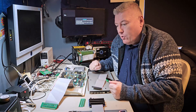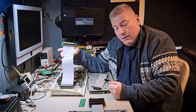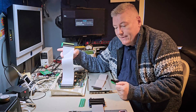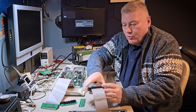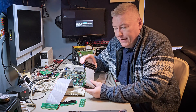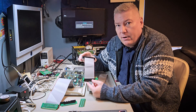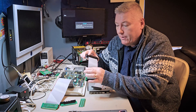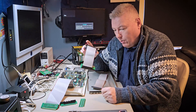So let's summarize. With the 64 pin cable, it works very good — it works in both systems we have tested it on. It has a problem when using the smaller 60 pin 2 millimeter pitch cable, and I think that is basically signal degradation because of bad quality cable — well, not the quality itself maybe, but the thickness of each cable and the distance between them is probably the problem.